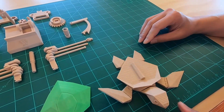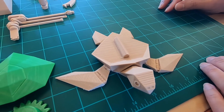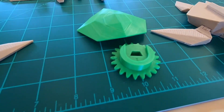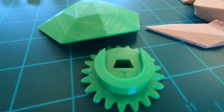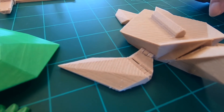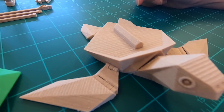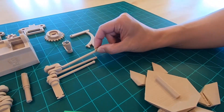There's a lot of flashing, but it seems the wood filament prints a lot rougher than normal PLA. The green one is normal PLA and you can see there's no flashing to clean up, but with the wood filament turtle there's quite a bit. That's fine because it actually sands pretty decent, similar to wood.